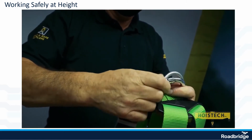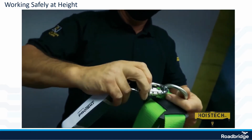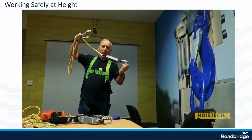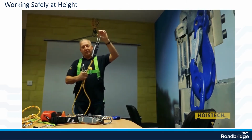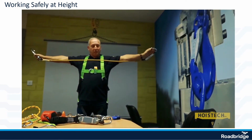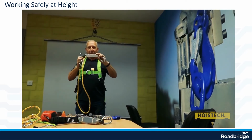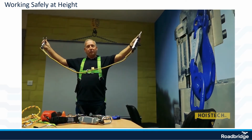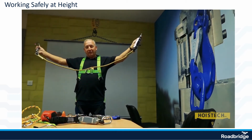So the second lanyard used will be fall arrest, which would have a deceleration shock pack if a fall occurs, which would take the load off the worker when he falls to decelerate the impact on the body. Very important when using this lanyard, it is 2 meters long, but normally there would still be 1.7 meters inside in the shock pack. So to be taken into account when working at height to allow for the total length of the lanyard deployed and a safety distance.